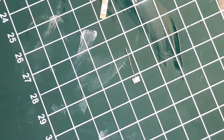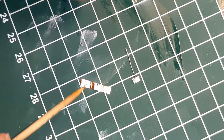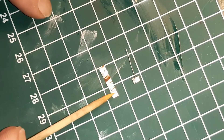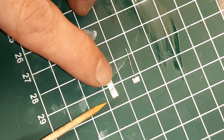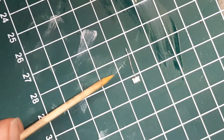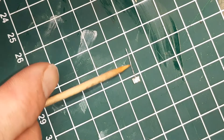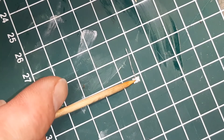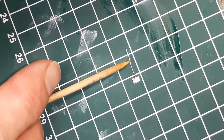Well everyone, this is a new soldering pad I created. What I did is I took this copper tape, cut it to width, peeled it off the backing paper, used brake cleaner to remove the adhesive on the rear, then folded it three times and created a new lead. I took two strands of copper wire, twisted them together, then tinned it and tinned the upper side of my new created soldering pad. Now I have to attach this to one lead and one lead where the circuit board is fairly damaged.